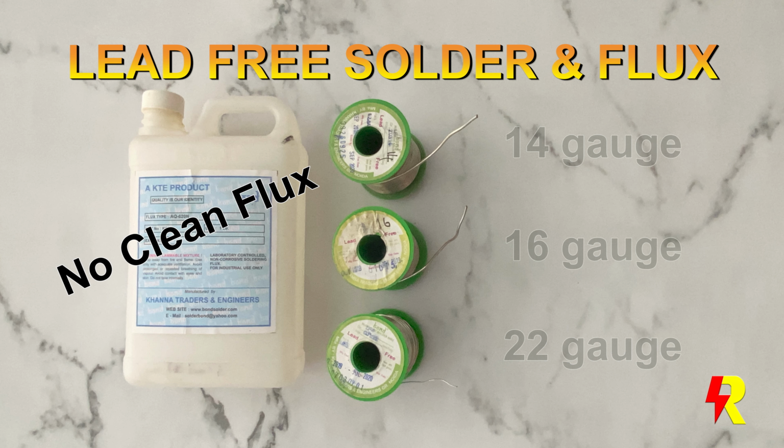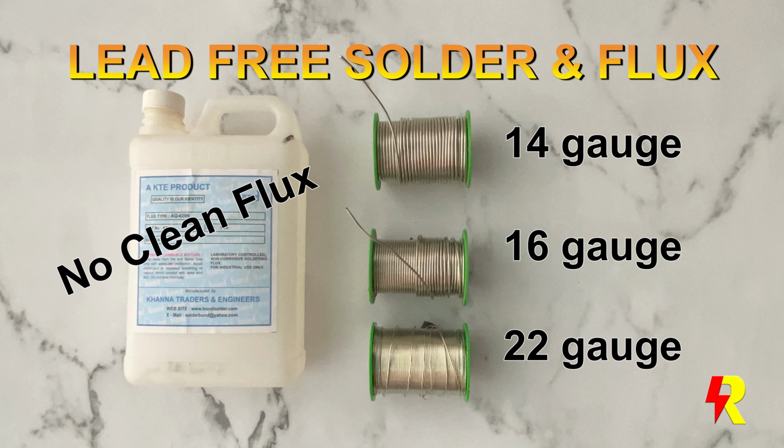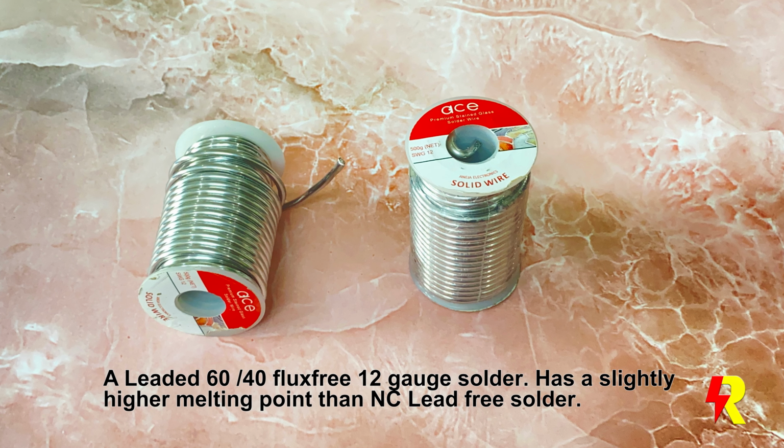Solder can be leaded as well as unleaded. Unleaded solder is an alloy of tin and small amounts of other metals. Leaded solder is an alloy of tin and lead, usually in the ratio of 60 by 40.